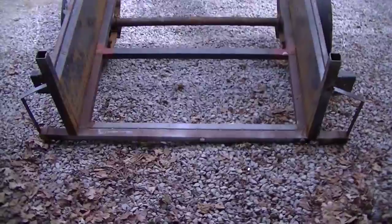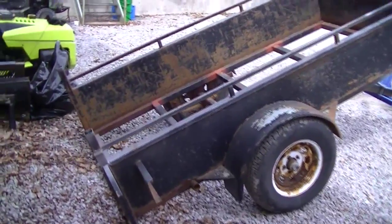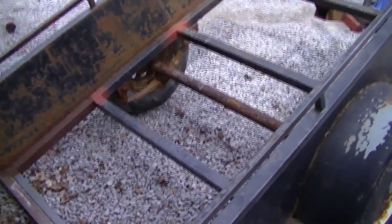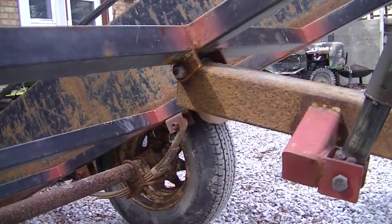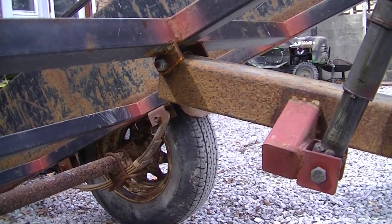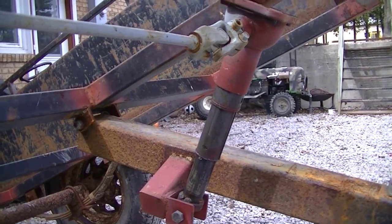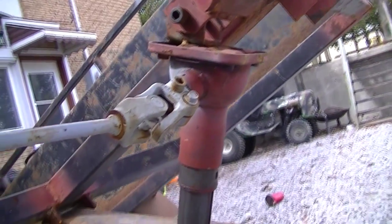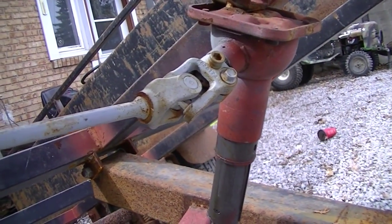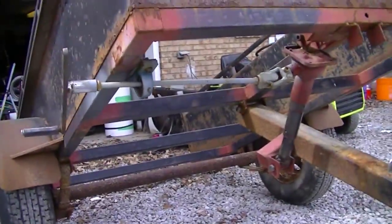So there you see, with it tilted all the way up, she's got her butt down on the ground. With it tilted all the way up, I can give you a better picture of what's going on. The entire trailer tilts on the axle as its fulcrum. The trickery is all down here in the frame — I've got a couple of pivot points welded to the frame, and those will be reinforced and gusseted. Things are still in mock-up right now, and the tongue pivots off that. The key to the whole operation is this Toyota pickup truck jack. I attached a couple of pivot points to it — one to the tongue and one to the trailer frame. And I've got a universal joint from a GM steering column, a length of shaft, and a pillow block bearing tied to the frame.